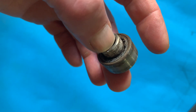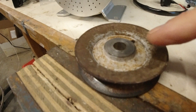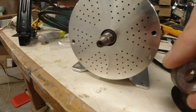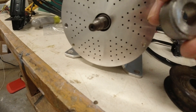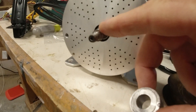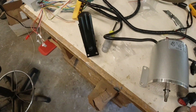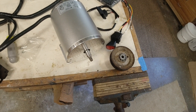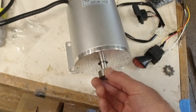Now this pulley had a bearing in the middle and I took that out and made a little insert that goes in here. This would be a little bit hard to do without a lathe. The shaft of this is slightly bigger than the drill bit that I have, so it won't quite go on. I need to make that shaft size smaller because my next size drill bit is way too big — it's just a little bit off in size. I have hooked this up with the batteries, so if you hit the pedal you get the rotation. This is hardened steel, so I'm going to have to sand it to get it to go on.